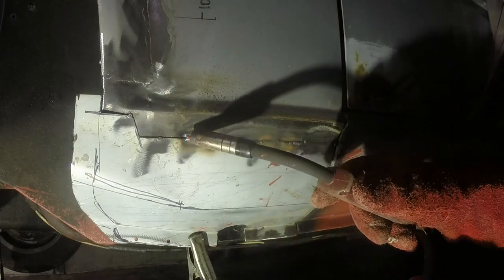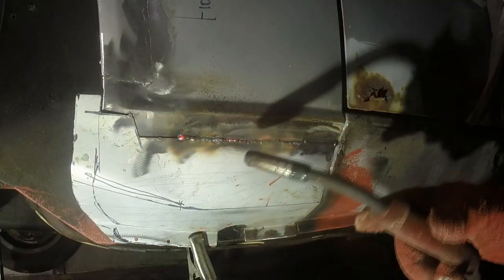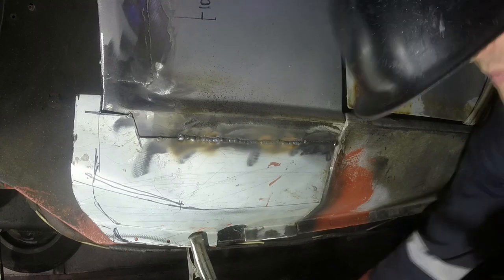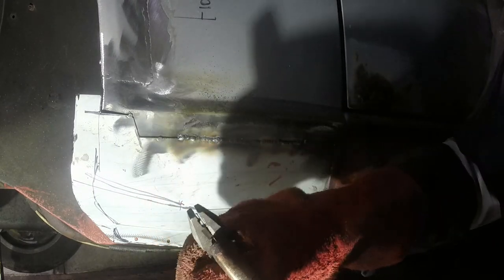I don't know whether you can see that, but my weld is jumping on and off more than it would be had I been going that way and sort of that way. See, it's altogether a pain in the arse, and I'm ending up with a really shitty weld, so I'm not going to demonstrate that technique of failure anymore. Hopefully you'll see a difference when I go the other way around. And I'm not going to clean it off, so I'm not cheating. I'm just going to tack there and up this way, and hopefully you should see a nice clean weld.